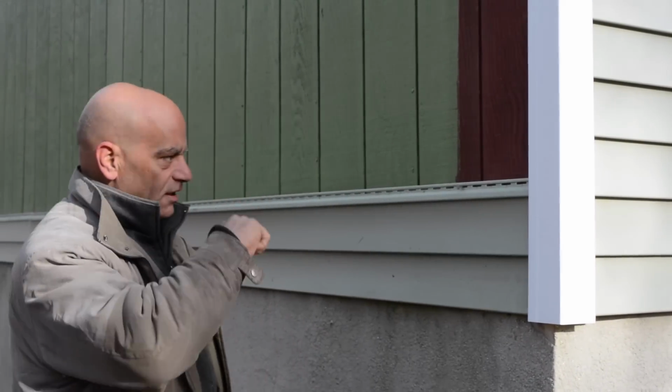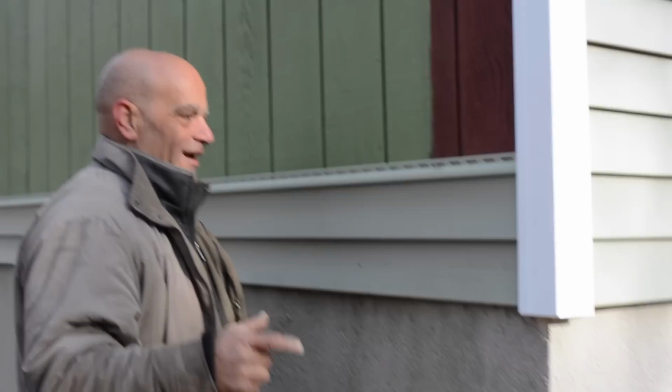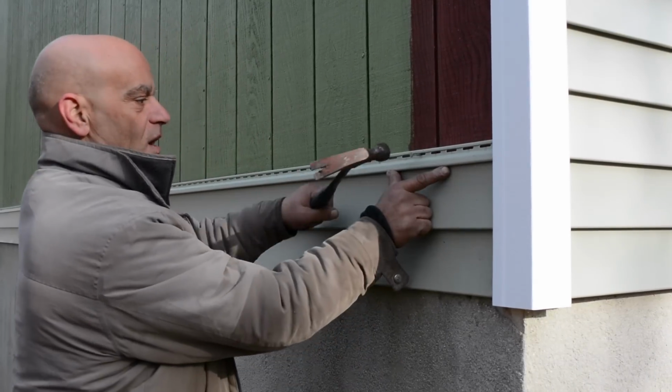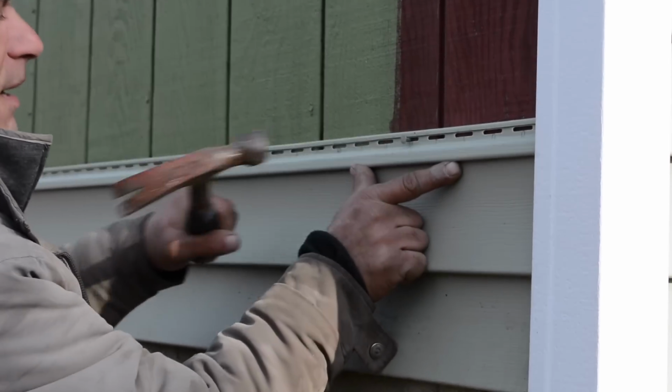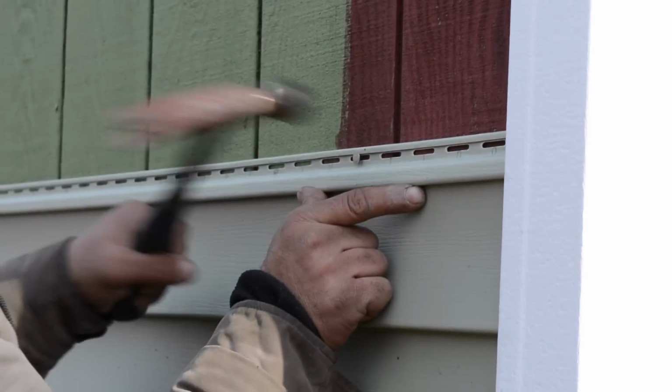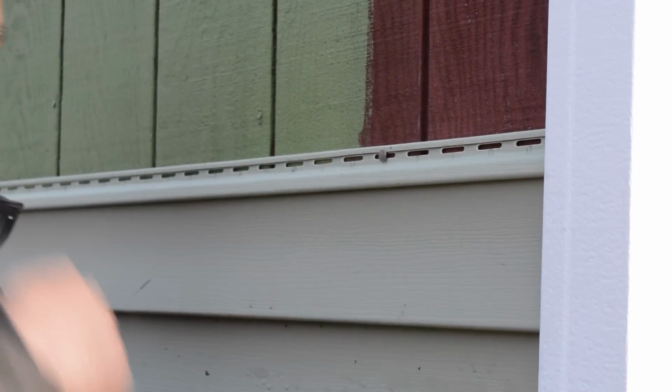All right, so Tom, let's get a close-up of this. I'm going to show you how you nail it, right? Some people just nail too tight. And if you nail too tight, what's going to happen? The siding won't move. Okay, so watch. Bang, bang, bang, bang. Bang, bang, bang. The witch is dead. Bang, bang, bang. Okay, come take a close look.